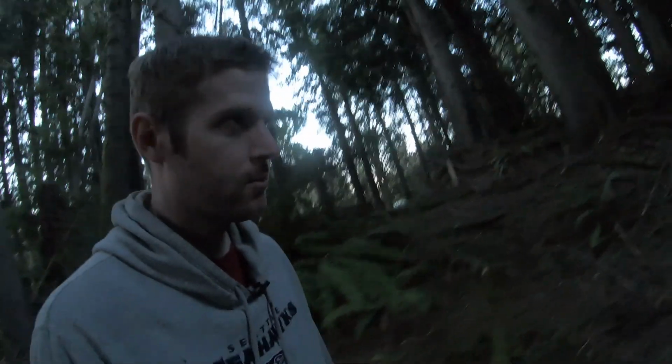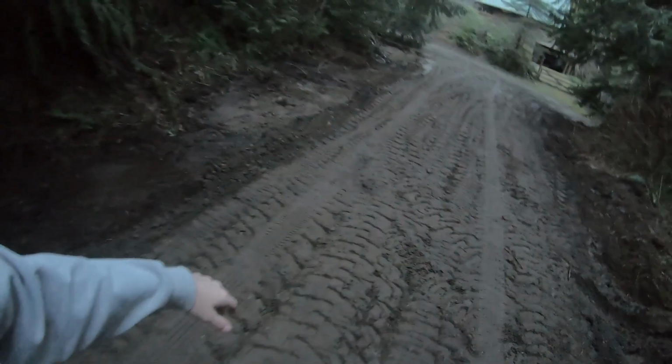That was a lot of work. So it's relatively flat. It's hard to get it perfect with that backhoe. I built this up at least about 6 inches, and when you bend down, you can see that the road is now higher than the ditch. I'm definitely gonna have to order some gravel to dump on here, because that last batch I dug out here and spread on the road had a lot of rock, but still some soil in it.